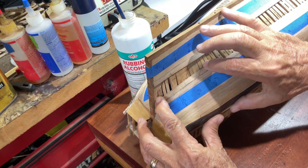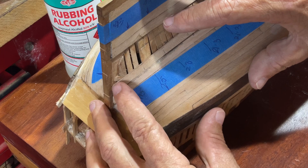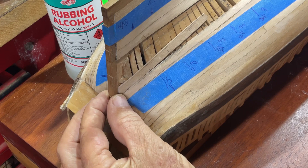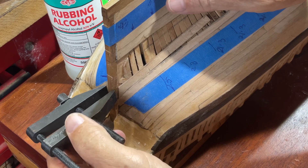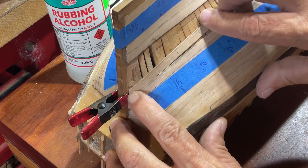You'll see there's a little bit of spring back in it, so how we deal with that is we stick this end with CA, use a clamp to hold this in place so it doesn't move, put CA at this end and PVA here, then use a clamp when that's caught and pull this into place, leaving it for half an hour to set. And that's how I bend pieces these days.